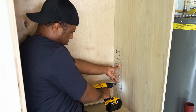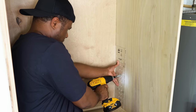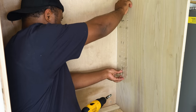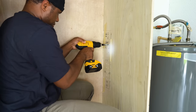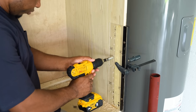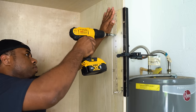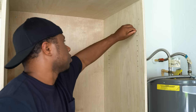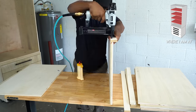The other side has fixed shelves for designated items. This side will be a bit more flexible — to do that I'm going to use this jig to drill holes from the bottom all the way up to the top so I can easily adjust the shelf pins and adjust the shelves. With so many holes to drill, I didn't want to drill a bad hole, so what I did was tape over one set of the holes and just left the ones open that I planned to drill. I like the shelves to have a thick look to them when I'm done, so I'll replicate what I did on the other side.